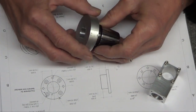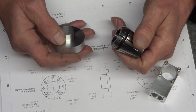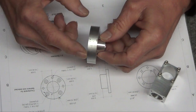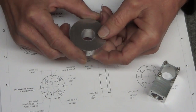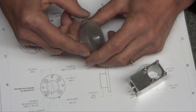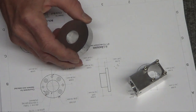So clean up the lathe, because it's a wreck trying to turn 2 inches down to 3/4. There's chips all over the place. Put this in, I just gotta turn this down, face it. Then, yeah, I got the screws, so there's plenty of room. Then I guess I can put this in a collet block.